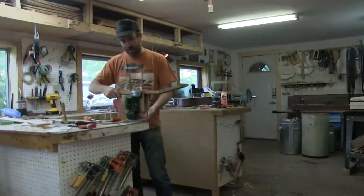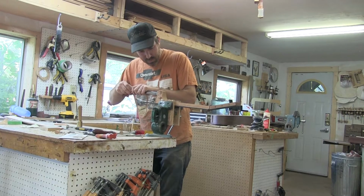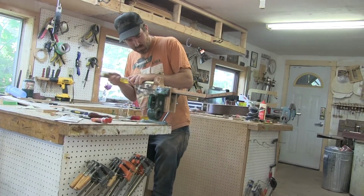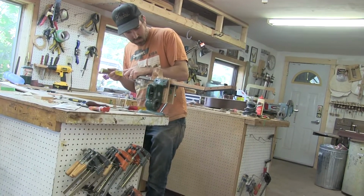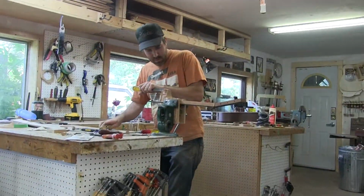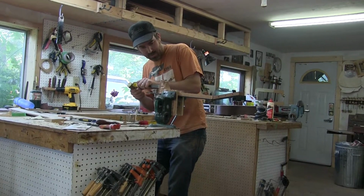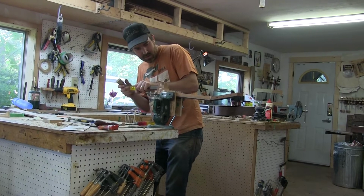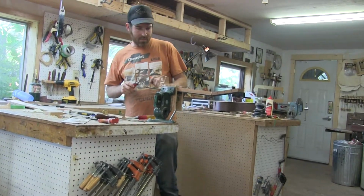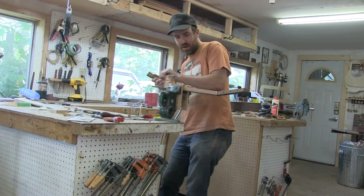Just outside, I'm going to give myself an extra eighth of an inch. Take it a little closer. Have that close. And this one. Now, because the grain is close to quarter sawn, sometimes even if it's a flat sawn neck, you can get a nice tear out like this. And then I'm going to start following the profile of the neck.